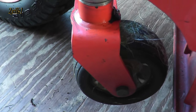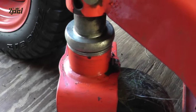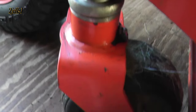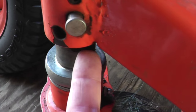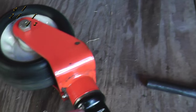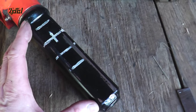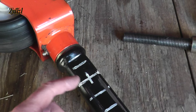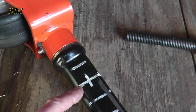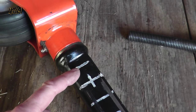Here's a better look at the wheels I used for the plow. They're the same ones as the mower deck has on it — I bought all this stuff from Kubota. The upper pin I cut off and machined down so it would fit inside the existing square tubing from the old skid feet. I have marks on here for every inch, easily seen when you're adjusting it. This would be ground level, that's up two inches, and you can also go down into the ground with this setting.